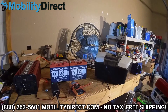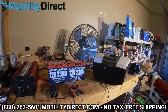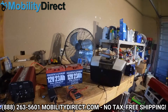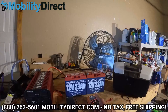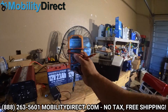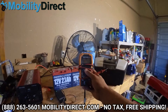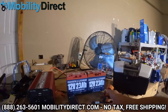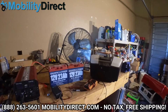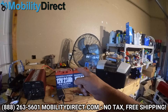These batteries can be called smart batteries because they have a chip in them known as a battery management system, which protects the battery from damaging itself if the user forgets to charge it and the voltage goes too low. A fully charged 12-volt battery is going to read about 14.2 volts on your voltage meter. When it's low, it's going to be closer to about 12.5 volts — that's almost completely dead. If it goes any lower, getting close to 10 or 10.5 volts, the chip is going to kick in to protect the battery.